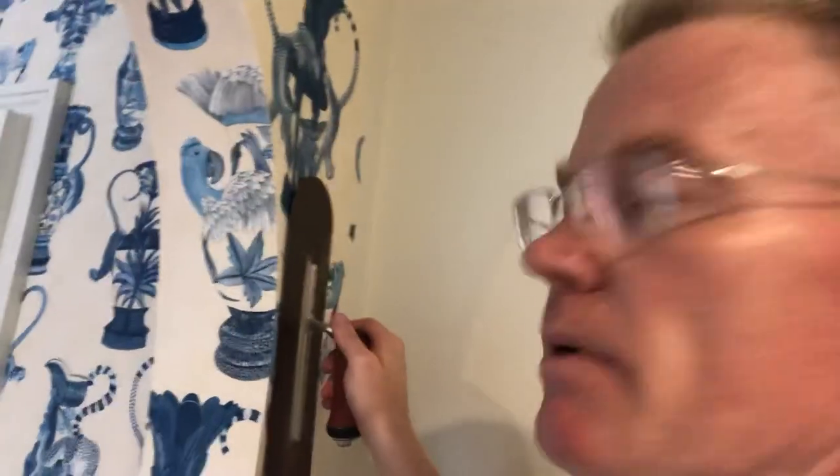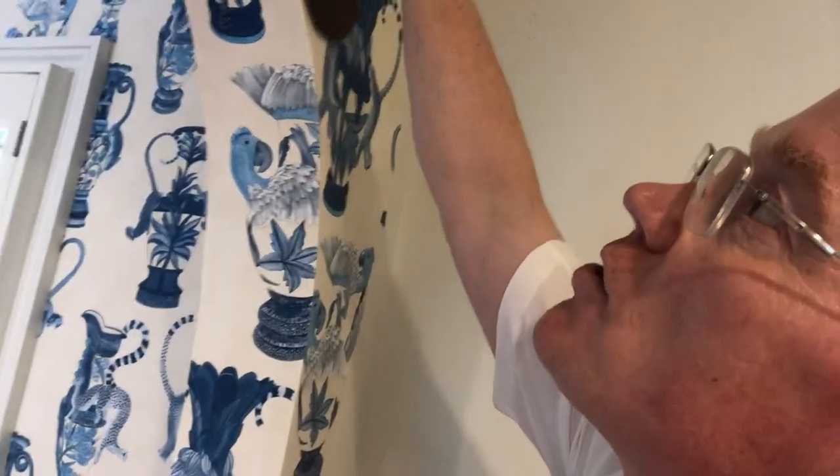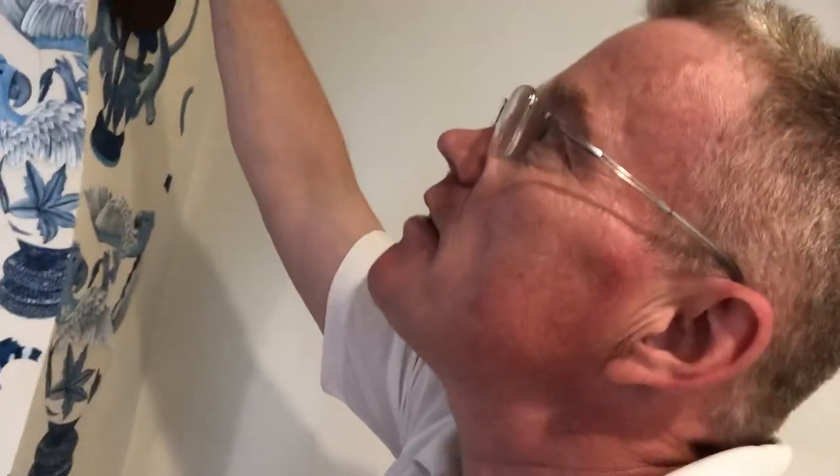By slicing against the metal edge, my blade is never touching the wallpaper directly. For those who are fanatical about perfection — yes, this adds about a sixty-fourth of an inch to the cut surface. I moved the blade all along the arch in order to protect the paper under that tool. You see, if the tool is on the paper, it can't get cut — and that's how you do it.